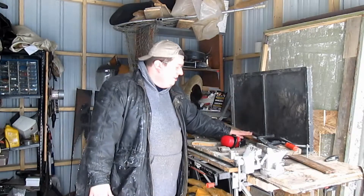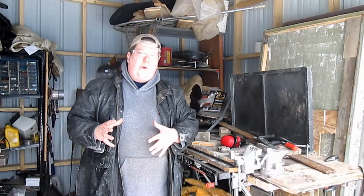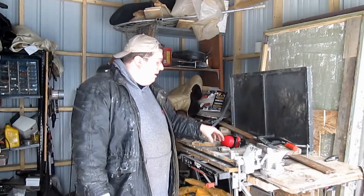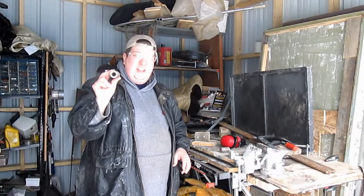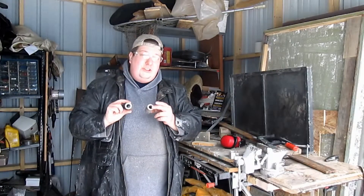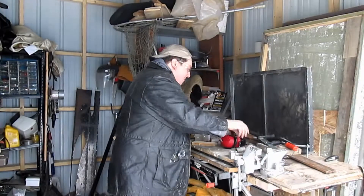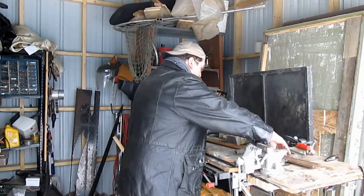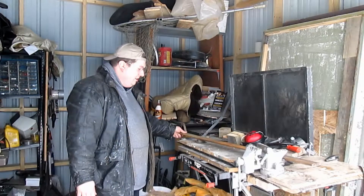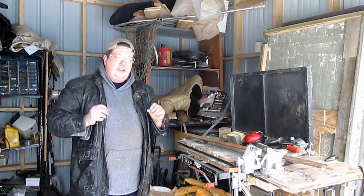You don't want to lay this big heavy thing down on a flat surface and slide it across — there's going to be a lot of uneven pressure that way. Remember, you're still putting a lot of force on just that little tiny cutting blade of your angle grinder. To reduce that, I use these long pieces of steel I got for free — lay them down on your workbench, which allows you to gently, consistently, and methodically push your cutting item into the blade on a nice straight cut.